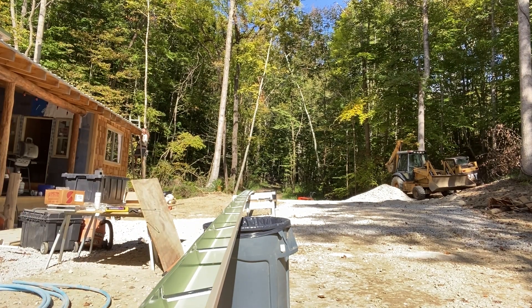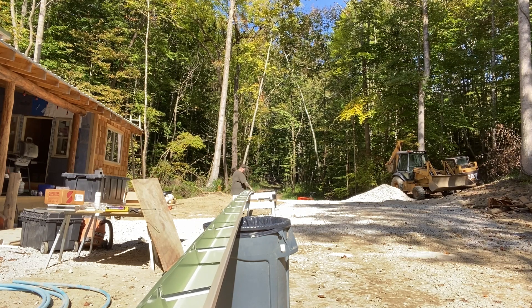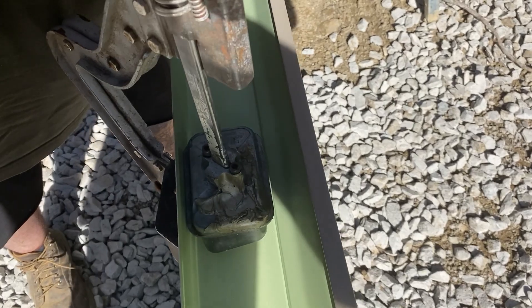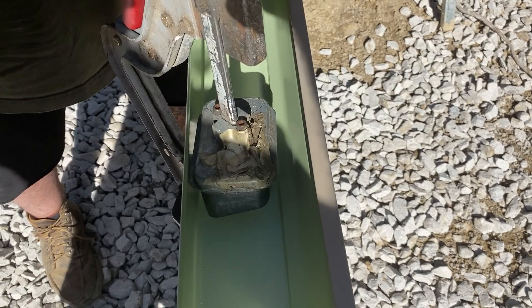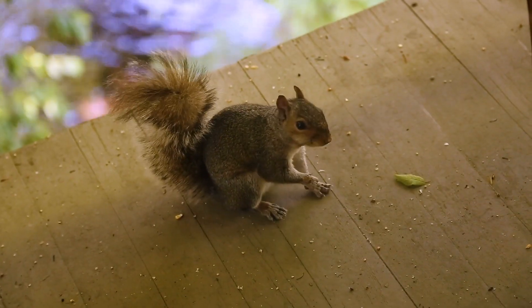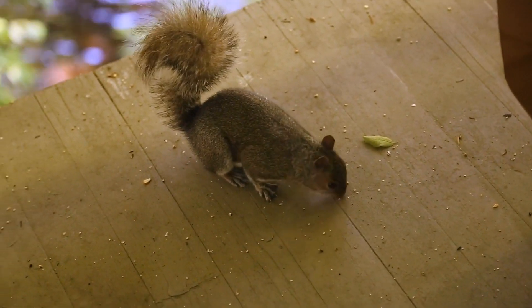Installing the hangers first provides a lot of rigidity to the gutter. Even for something like a 50-foot gutter, it'll make it a lot easier to hang. This is a downspout punch — it works kind of like a clamp. This is a 3x4 downspout, an oversized one. We clamp it in, it punches the hole out, and we'll put an outlet in there and hook the downspout up to fill it up.